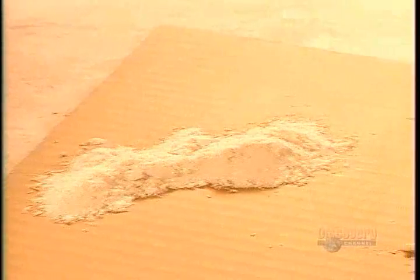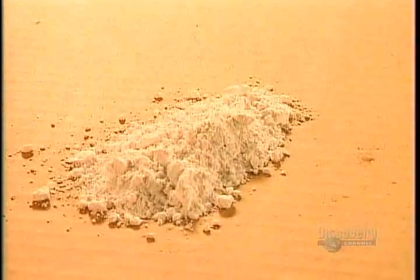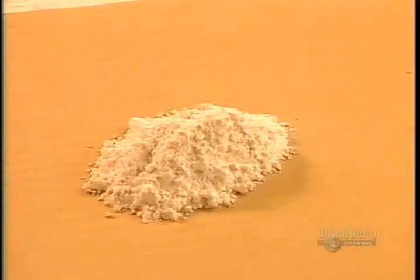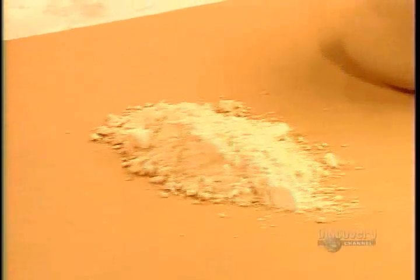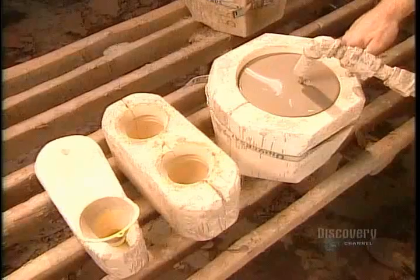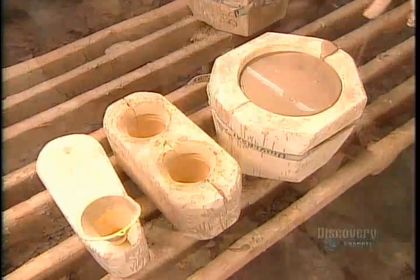Earthenware is made of talc, a mineral called nepheline syenite, a dark beige clay known as ball clay, another mineral called silica, and a white clay known as kaolin, all mixed with 40% water. They pour the mix into the production mold with careful, even pressure, again to avoid creating air bubbles.